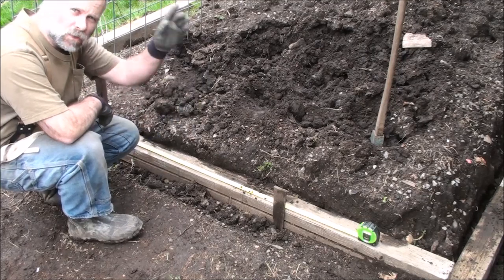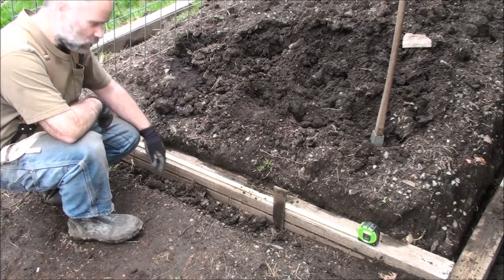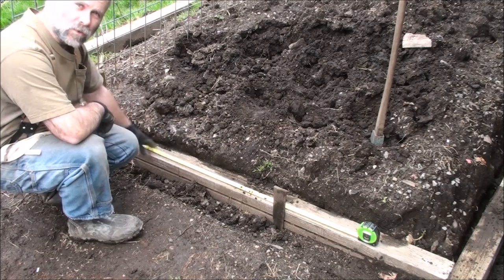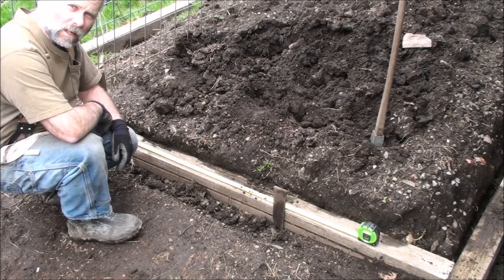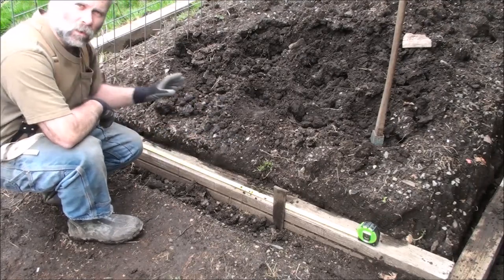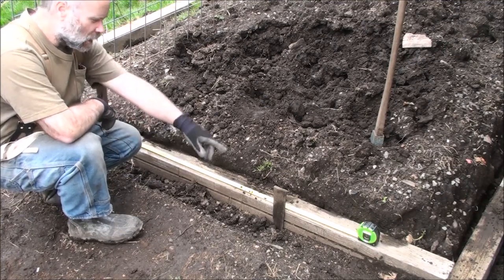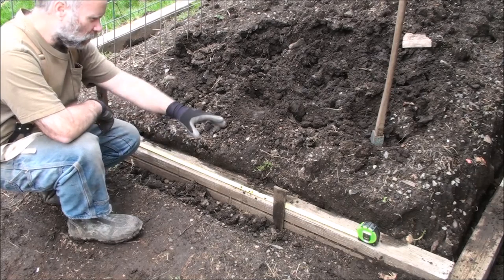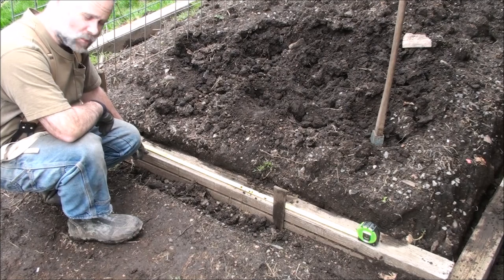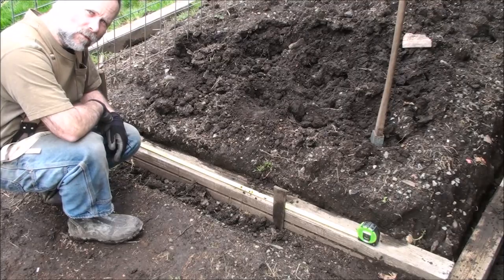In the event that we do close this in like a greenhouse, we'll have an access door to get in and out. I've got a 36-inch opening right in the center of the structure, and that's what I'm doing right now — laying that out. I'll go ahead and remove this 4x4 and dig my holes for some posts. With the indentation where this 4x4 was, I'll know where everything is straight and true so I can get my posts in the right position and square with the front of the structure.